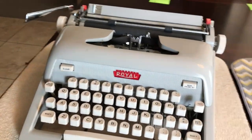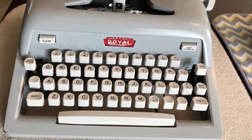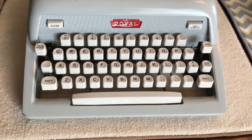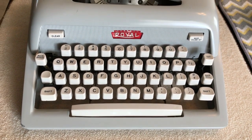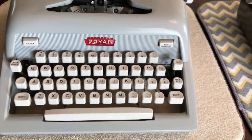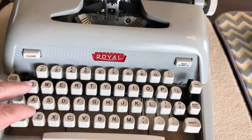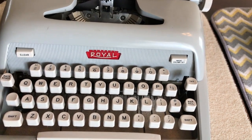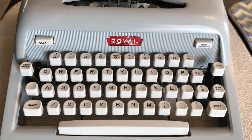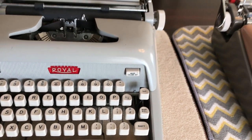It became the goal later on in producing typewriters and keyboards to get a full-size keyboard, and by that what they meant is it would have the same number of keys as the typewriter you might have at work, or if you were going to school and learning on their typewriters, they would have more keys. They would have a set of 44 striking keys. I call them striking keys because they hit the platen. So they're ones with typefaces, type slugs on them, and would leave that impression as opposed to, say, a shift key. But everything else is about the same.